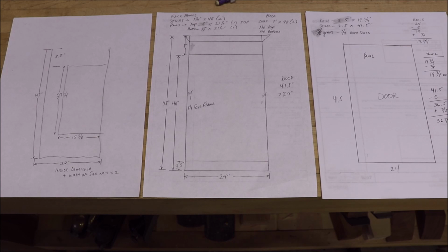Doing this, I have found for me, makes the project go a lot faster, because once I have it written down, I can go through my cut list, make all the parts, and then move on from there knowing that I've got everything that I need and not having to backtrack going back to the jointer, then the planer, in order to make some more stock up the right size because I forgot something.